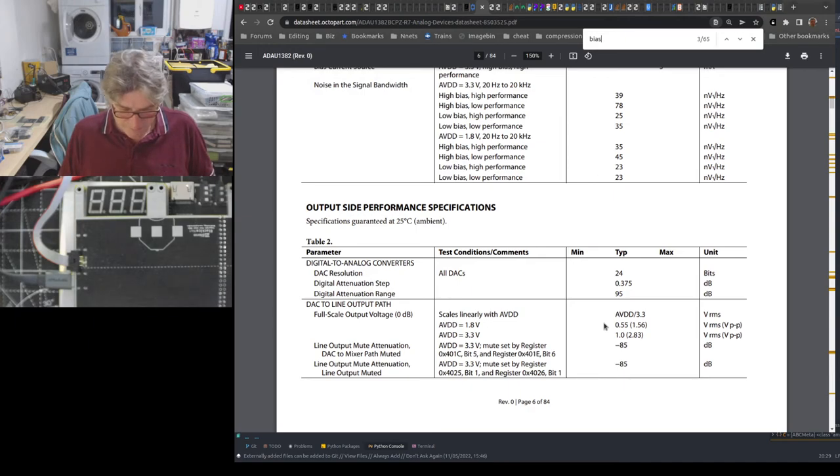Oh, my USB power delivery chips arrived as well, which is good. The alternate ones, the ones that aren't teeny tiny small CSP ones, but QFN ones, which is good. So that's what I've designed for when I moved the power delivery onto the Ice Logic bus. I swapped back to using the ones that we did in the December prototype, the QFN chips. So they arrived as well, which is good. So I've got everything I need, basically. I'm still awaiting a delivery from LCSC in China, but that's just more of a lot of what I've already got. I'm covered for the development batch.